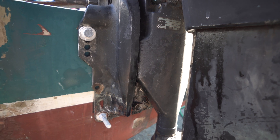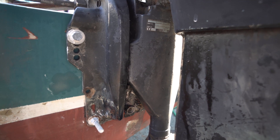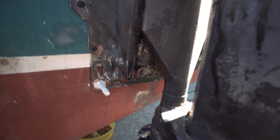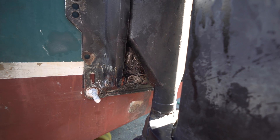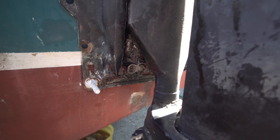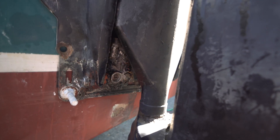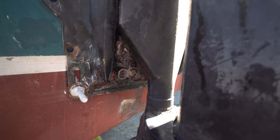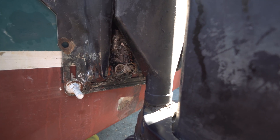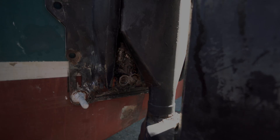Remember, it is pretty heavy. I think one person can do it, but it's not an easy task — it's definitely much easier with two people. One more quick note: be very careful not to unscrew the manual release screw too much, because especially if the motor is up, or even if it's just down, there's a chance it will pop out and all the hydraulic fluid will flow out. So when you unscrew it, just unscrew it a little bit, and if you're not sure, keep pressure on it, because the hydraulic fluid will burst out and you will have to refill the entire machine.